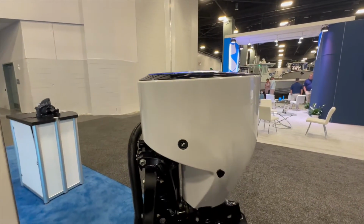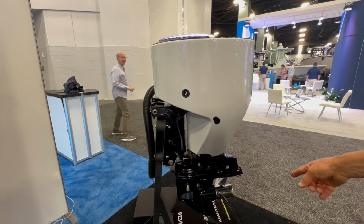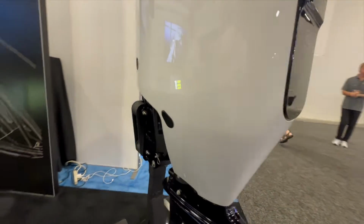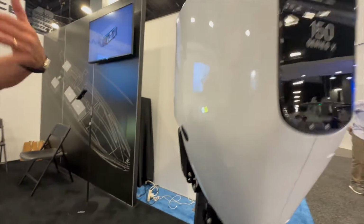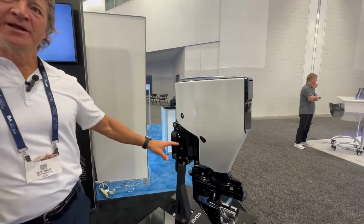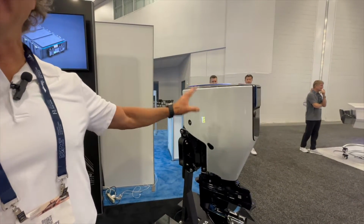So there's additional, and also the other is exhaust. In traditional outboards, you're putting the exhaust into the water. You don't need that because electric motors don't make any. There are no emissions to do. So you can cut that. So there's, yes, cost saving, simplification that can be done with the lowers, if it's expensive tooling and such. So it's 150 horsepower at 400 volts. If we have additional battery packs, we can run this motor at 800 volts.